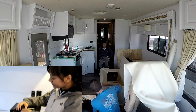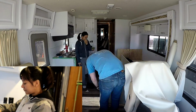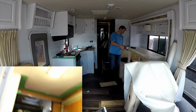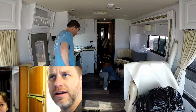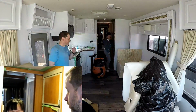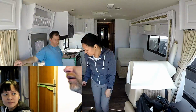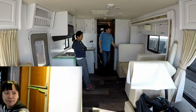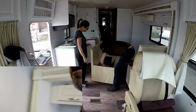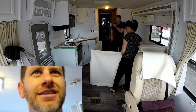That's right. So what we did was we washed all the cabinets with TSP. I think the recommendation on that paint is simply to wipe it down. So we did TSP quickly to take all the grease off, and then we did a quick sand, just with 180 sanding blocks. And that was it. And then you can paint away. Basically, you can just paint over everything with that. That's what we painted all the walls with, all the cabinets with. Marge painted some of her hoodie with that, and that's about it.